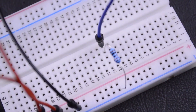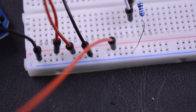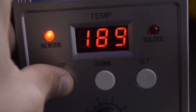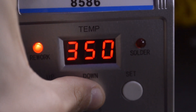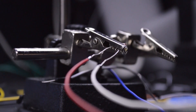The positive and negative from the servo go directly to the breadboard. We need to add a 10k resistor that connects to the ground, and the output will go to the LDR sensor. This wire goes to the LDR sensor and the other one goes to analog pin A0. I soldered the wires, so now let's connect it to the breadboard.